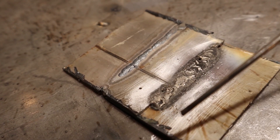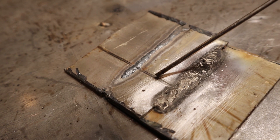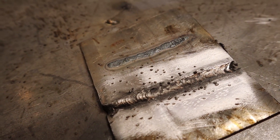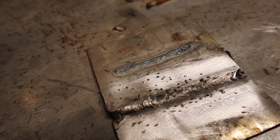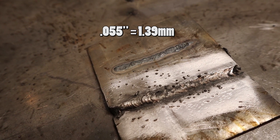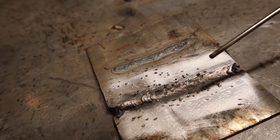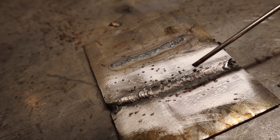My first pass on the really thin stuff I ran on about power level C, and you can see we were getting some pinholes. The whole time I was fighting the top piece melting back away from me — I wasn't entirely happy with it, and it looks really blobby. I turned the welder down and tried again; it's a little bit cleaner but was still melting away. This is 55 thousandths of an inch — less than a sixteenth — so overall the welder did fine, but it just goes to show you're still going to have to really work to weld material this thin.